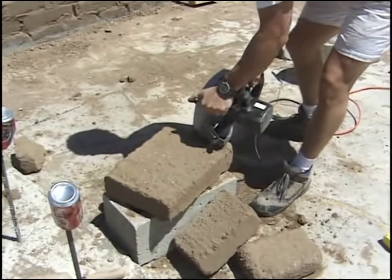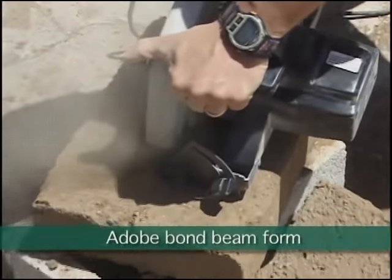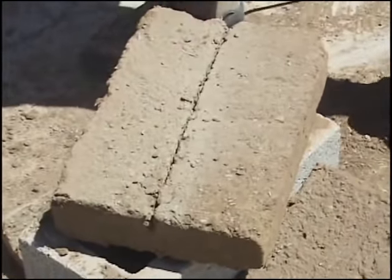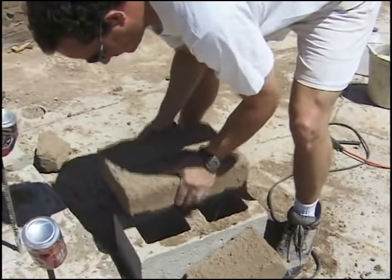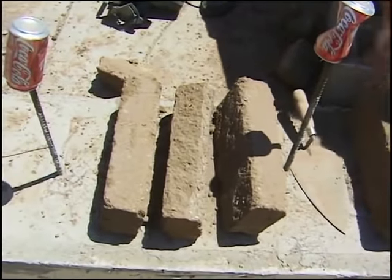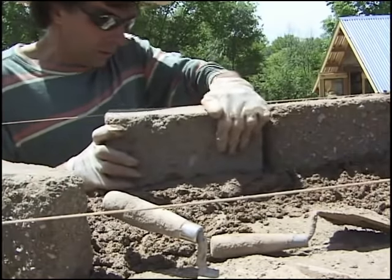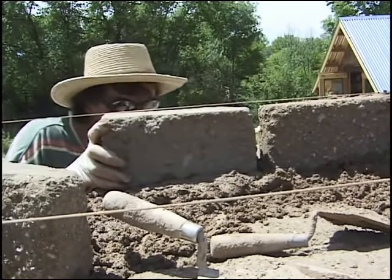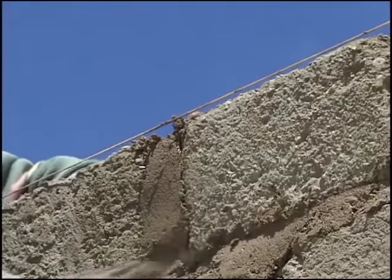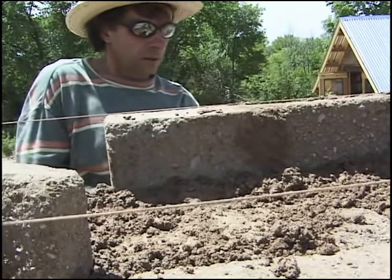What you're going to see here are three different types of forming up the bond beam forms. Tom is cutting adobe blocks with a power saw with a masonry blade on it, and we're using these as the form itself for the bond beam. The first system is for the two-foot-thick solar mass wall. Code in New Mexico says the bond beam only has to cover two-thirds of the width, which gives us some flexibility to use adobe as the form material. These are put into place with mud mortar, cut to the right height so we're at least six inches thick, forming a trough that we'll pour concrete into at a later point.